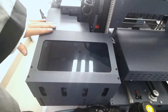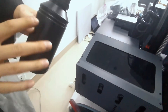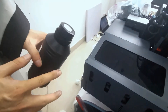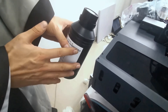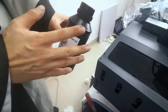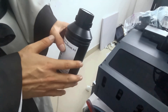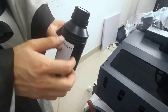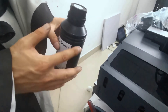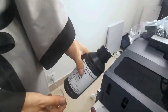After we install the cover, we may still have half or some remaining ink we need to use for next time. We need to close the cover and store the ink without sunshine, without any strong light, and also without high temperature. Put it in a good environment with good temperature — about 18 to 22 degrees — and also humidity about 70 percent, and without strong sunshine. We also need to check it every week, even if we don't use it, and shake it to mix it.